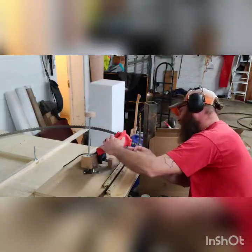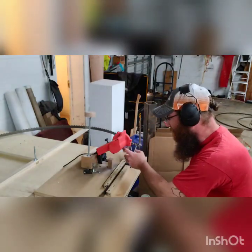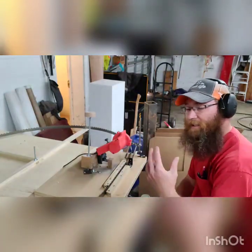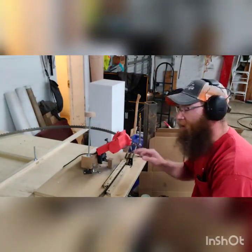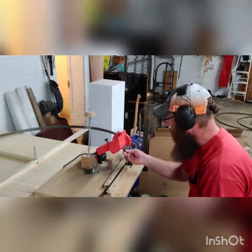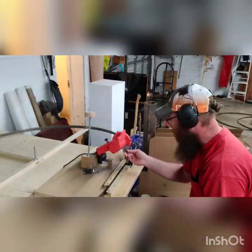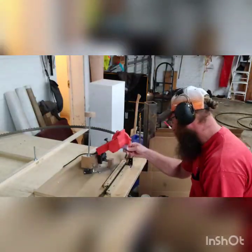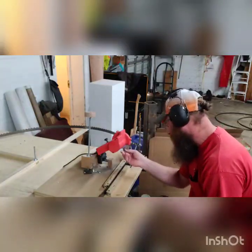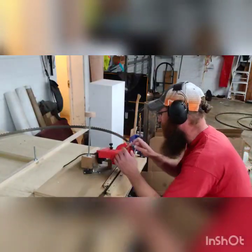These blades get really dirty. The gunk from the blade builds up on the grinding stones. The pores get filled with metal, grease, and gunk that comes off the blade. So you do need to clean them. Just turn it on. Use one of these little stones. Get down in there. Clean that off a little bit. And then shake the piece up some. And it's done.